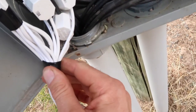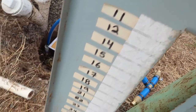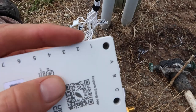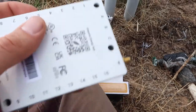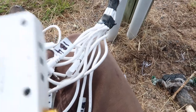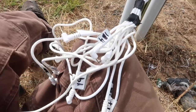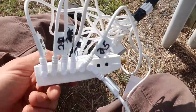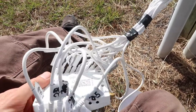I'm taping cords as they come together. In my box the first circuit number is 11 and the last is 26, so this unit goes 1 through 16, where port 1 corresponds to site 11, port 2 to site 12, 14, 15, and so on. I've taped until I reached my first cords, then started plugging them in, taping any extra length as the strands get longer. All CTs are now plugged in, 11 up through 26.